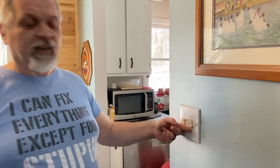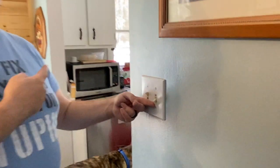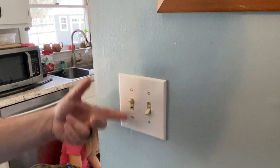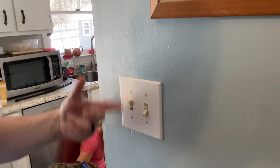You very often find three-way switches in stairs — at the top and the bottom — so you can turn the lights on and off. The disadvantage of a three-way switch, as you can see here, is that the lights this controls are both off but the switches are in opposite positions, because it really depends on the position that the other switch is in. So on and off becomes irrelevant, and that's why there is no writing on a three-way switch.